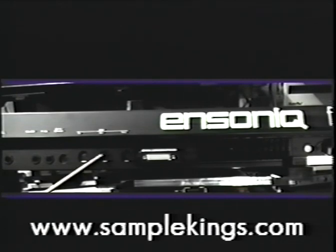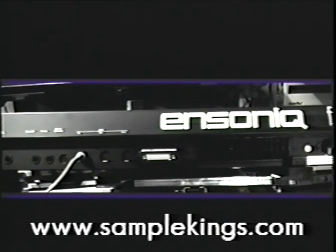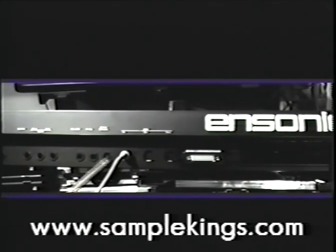Moving right along, we have our MIDI through port. We have our MIDI out for sending MIDI information to other sound modules and keyboards. And we have our MIDI in for taking information into the EPS. A good application for this port would be to sync our keyboard to a sequencer or a drum machine.